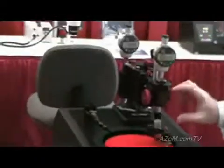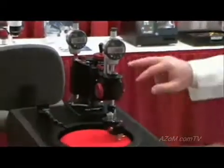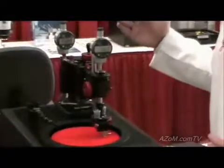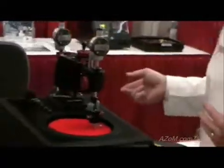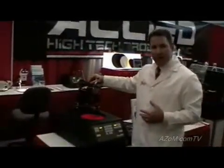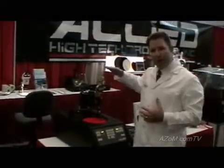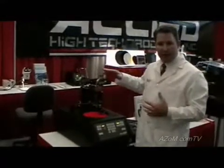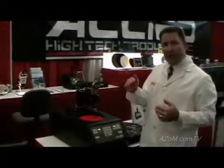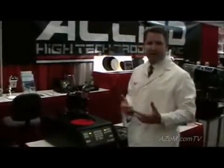Digital indicators on the spindle at the front and at the rear help you determine the vertical position of the sample. The front indicator tells you the rate of removal — as material is removed from the sample, the indicator counts upward or downward depending on whether you've selected the positive or negative side. The rear indicator helps you adjust the vertical position of the sample. For coarse grinding you can remove 100 microns, 200 microns, and then move to the front indicator where the finer abrasives operate more slowly in a controlled manner. The front indicator also tells you how effective your abrasive is at removing material.